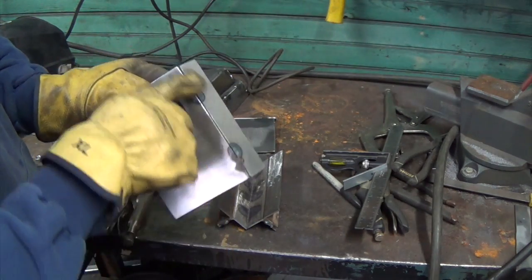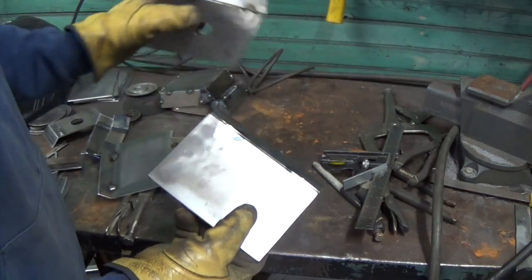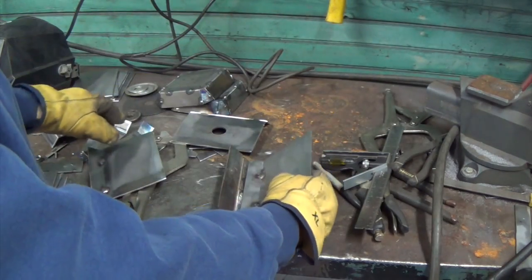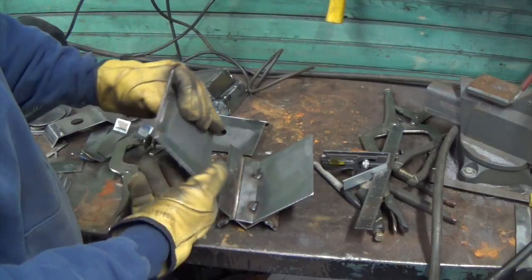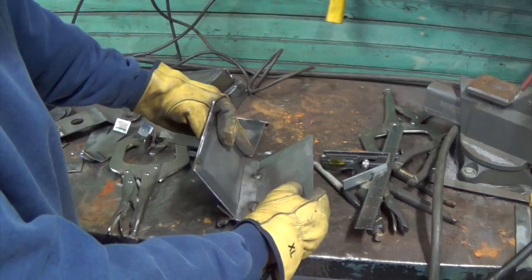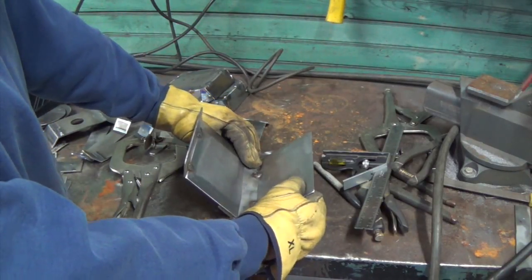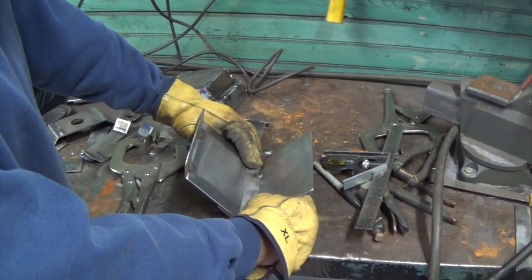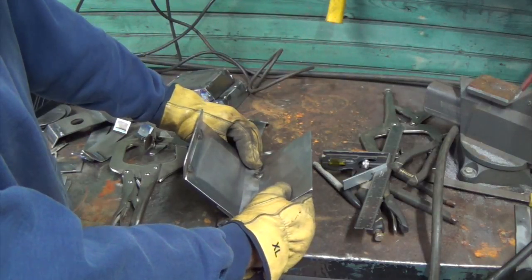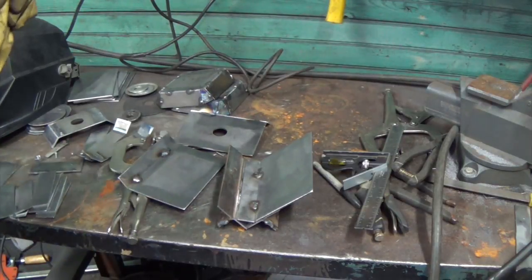I worked very hard to get these very consistent. So I'm just going to have to throw a tack on there, because I don't know another way to make sure these are 45s. I guess I can try and change that jig that I use or make another one. But anyway, I like this one. It gives me a perfect 90 here, and therefore a perfect 45 here. So I'm going to go ahead and make the box, and I will see you in a bit.